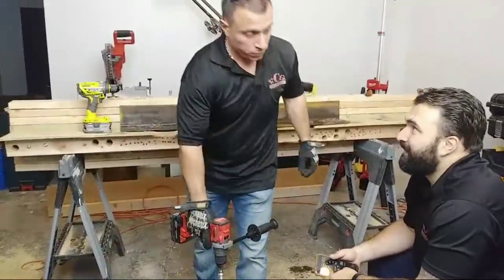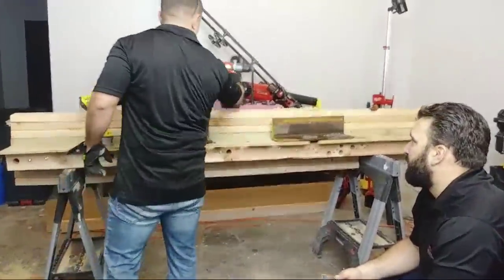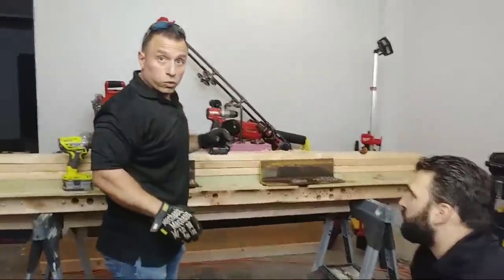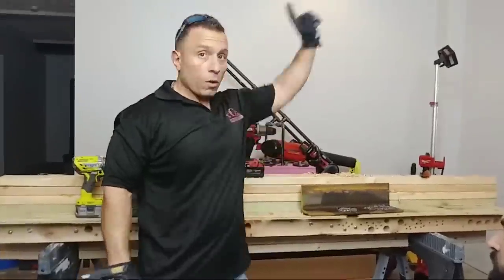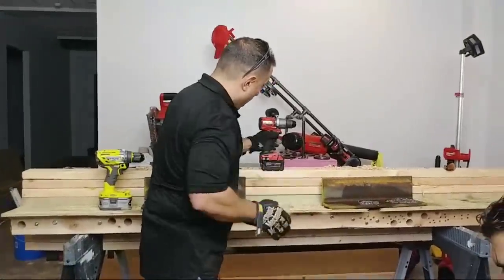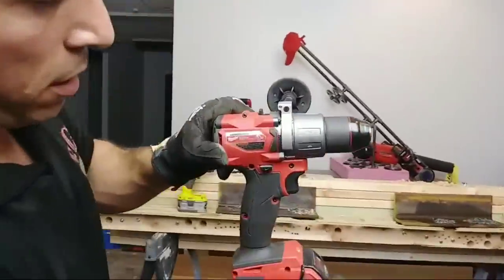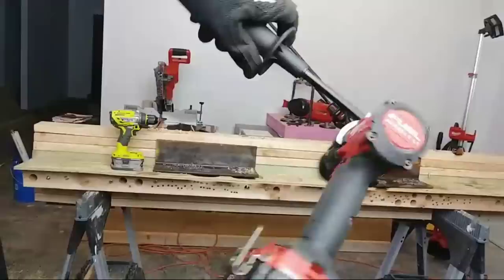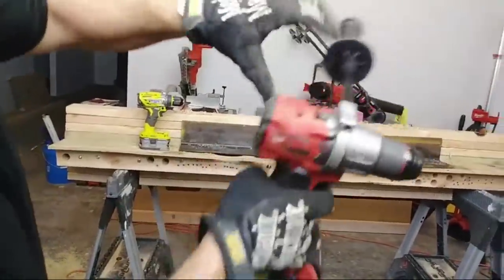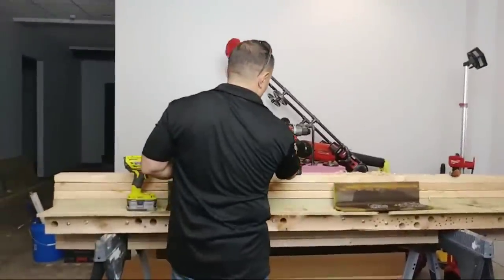Okay. It's a difference. So, I will say this. Very similar to last week's tool war, we'll link it here. In this area, the gun got extremely hot. You're starting to see some grease leaking out of the gear case, only on the one side. Now, whether that's from deflection or pushing down, I don't know. But let's take some temp readings.